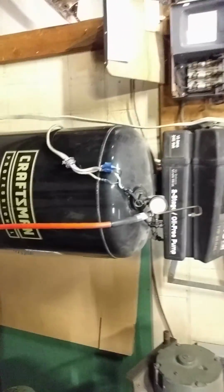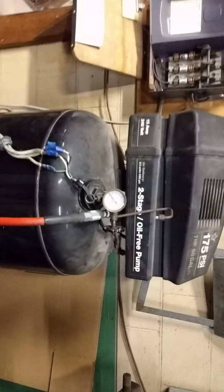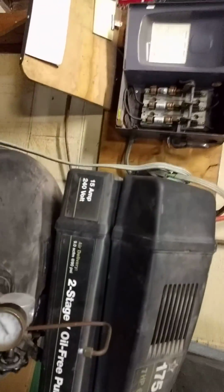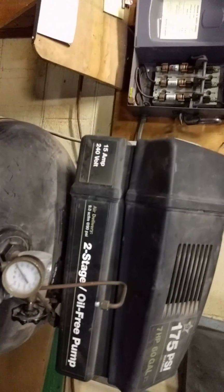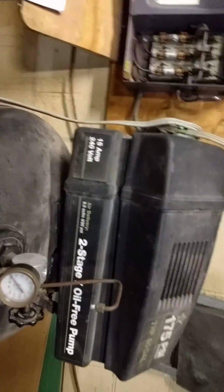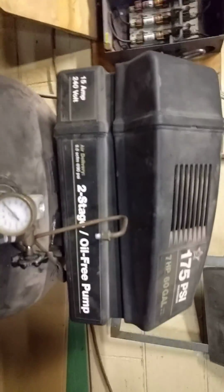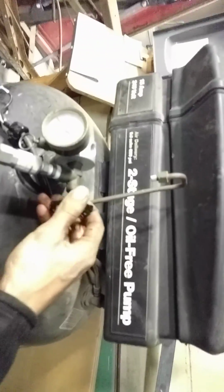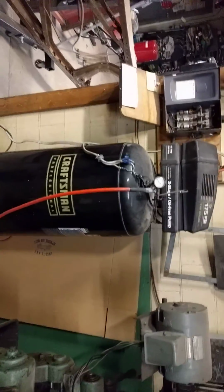It's been kind of a pain to get this rebuilt. I knew the cylinders needed to be redone, and it worked for a day. I mean, the thing's 13, 14 years old. The junk that was in the cylinders could have gotten into the line, could have plugged up the check valve. It could have done something with the pressure switch, or I think there's a diaphragm in the pressure switch. It could have ruptured from just use. And now that this is actually putting out real compression, because the cylinders were shot, but now that it's up to par again, maybe that extra compression blew it out. So anyway, I ordered parts for that, and like I said, it could be 2 weeks or so before I can finally get this thing running again.